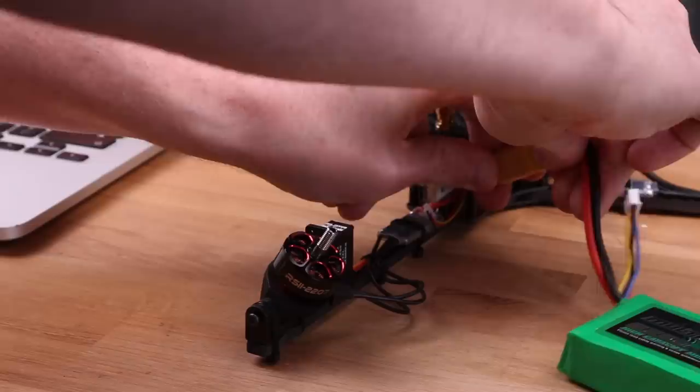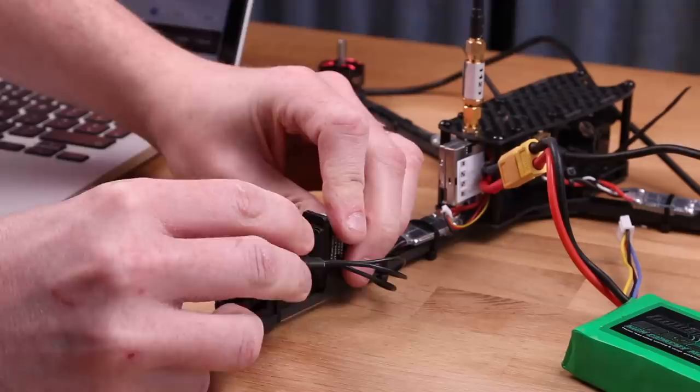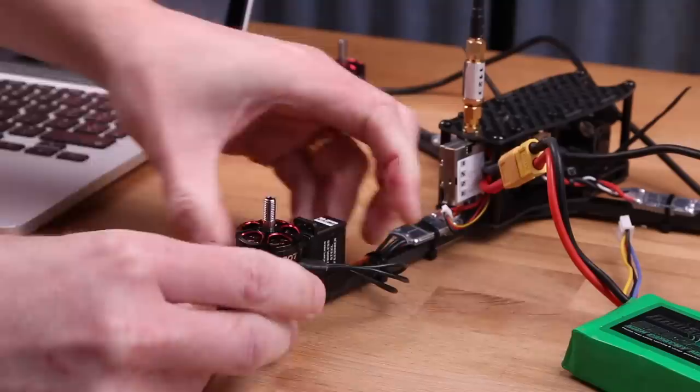step that you need to do first, and that is to center the tilt mechanism on the servo. So when the servo is active and sitting at 1500 microseconds in the computer, then pull the servo out of the tilt mechanism, adjust the tilt mechanism so it's pointing upwards, and then slide the servo back in. It might not be possible to get it perfectly straight up. That's okay. Just put it in the position where it's leaning the least.